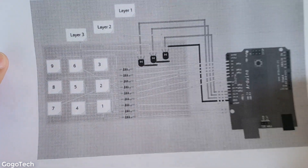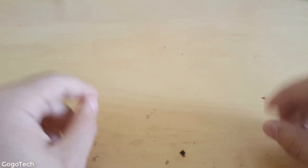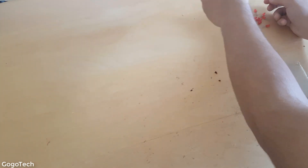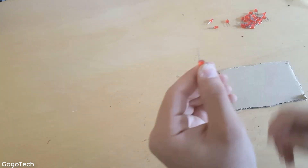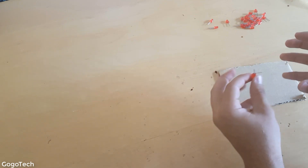Now I'm gonna put on a time-lapse and show you how I did mine. First thing: get your LEDs out and bend the negative lead like so. How your LED cube turns out depends on your LED leg size.